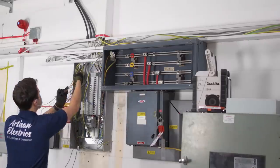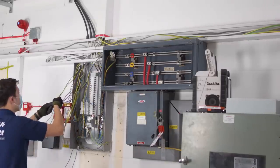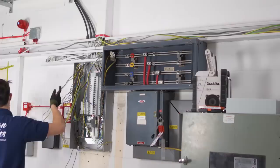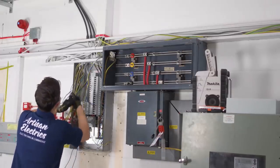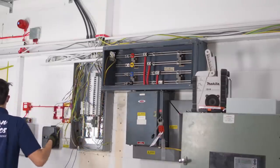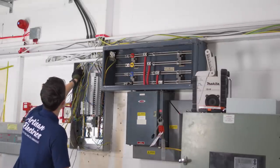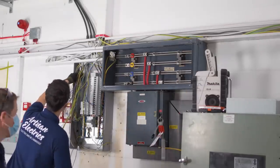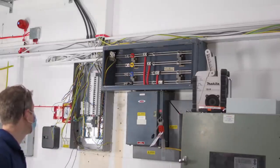And is this DB schedule actually accurate? It seems to be so far, yeah. That's good. So I was writing it out as I was going. Then are you just labelling them up for the same circuit numbers that they were in before? Exactly, yeah, because I don't know if whoever designed it put the phases where they were for a reason. Yeah, you know? To avoid dangerous touch voltages between two 4L heaters. Yeah, 4L2, first floor heater, right, yeah.